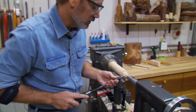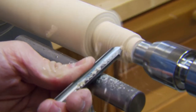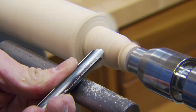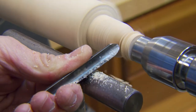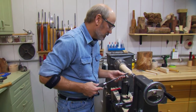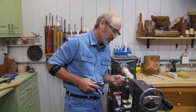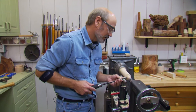Got that locked down at the right height. Now we start making our curve. As the adult, you'll start making the ball. It's like sneaking up on a bead — a ball is one big bead. As an adult I'm going to pick the speed up, because as you get into the smaller diameter, you have fewer feet per second moving, so you have to pick the speed up to make a good cut. We just don't want to scare them with speed right off the top. As I'm making the turn, I've got the tool in my hand — it's a body rotation movement. I'm leaning to the left, raising the handle, turning the tool, and swinging my body to keep going around the corner. The kid can watch this whole process and learn, because they're going to make some beads here in a minute.